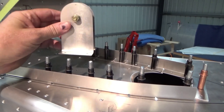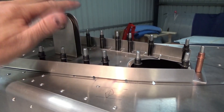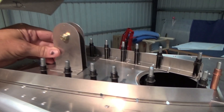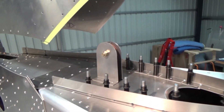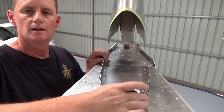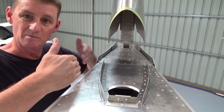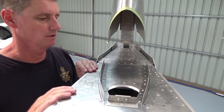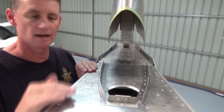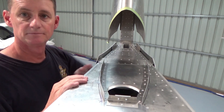Here's one we prepared earlier — the elevator up cable pulley. Runs across the top of that; that's already been mounted. I did that in an earlier video — I remember I had the string across the top, back in the shed when I was banging my head on the roof. So I've got those two L angles all riveted on nicely. I riveted those on now, and now I'm going to actually bend them over — they're on there permanently. Also put in the cable guard; that's where the bit of Teflon goes to stop the elevator cable rubbing. Now we just bend these over to match this angle here.